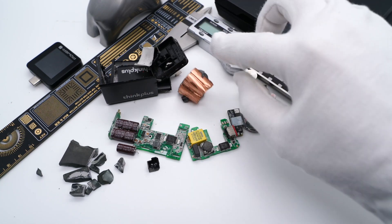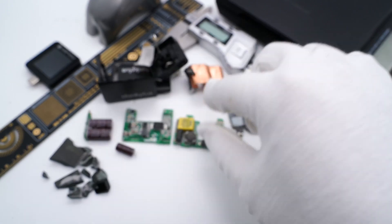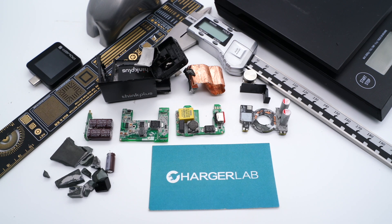That's all the components of this Lenovo 65W nano charger. In order to reduce the size as much as possible, it adopts a planar transformer and spatial structure. Three small PCBs instead of a single complete PCB significantly improve space utilization. The entire module is wrapped and sealed with silicone adhesives, which greatly enhances heat dissipation performance. That's all for today's video. Please drop a like, leave your comments, and subscribe. You can also click the corners to view other teardown videos of Lenovo products. I'll catch you guys in the next video. Bye.